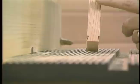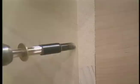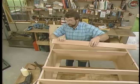With the same dovetail bit mounted in my router, which is now under this router table, I'm able to make the male part of that dovetail joint. For the upper portion of the chest, the top and bottom pine panels get fastened with some screws. Well, glue, along with our dovetail joint, are the only things necessary to hold the rails to the sides.